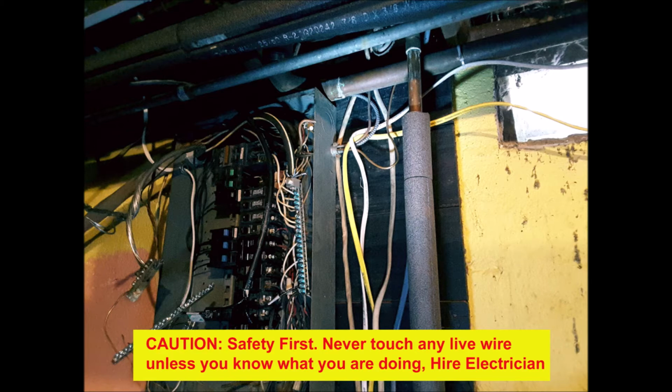As I noticed the breakers rusting to the point of causing serious problems, I replaced them. Grounding and adding to the neutral wire bar became difficult, much of it because of rust. Some ground wires were so rusted in I had to add two additional bars. Since I wasn't able to attach them to the box inside, I left them floating in the air.